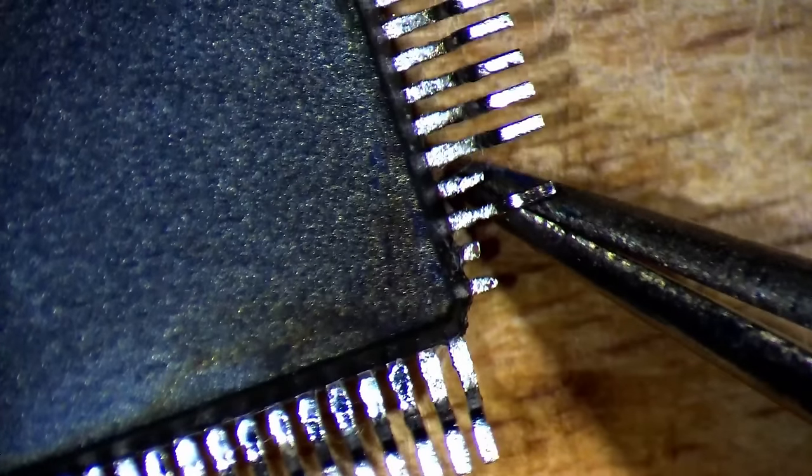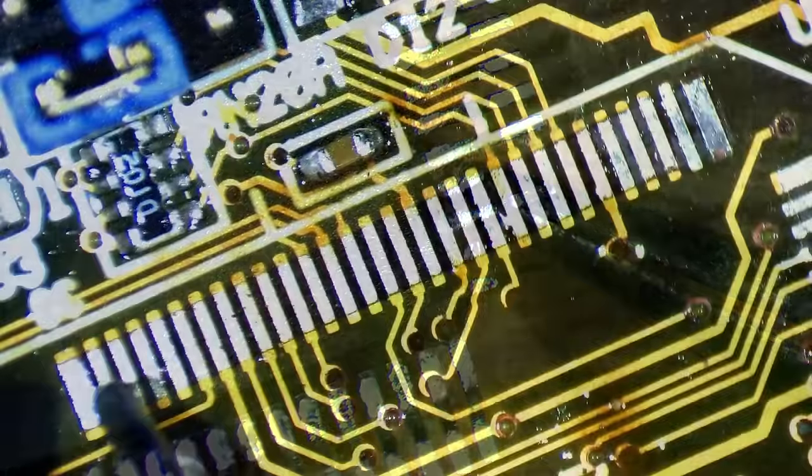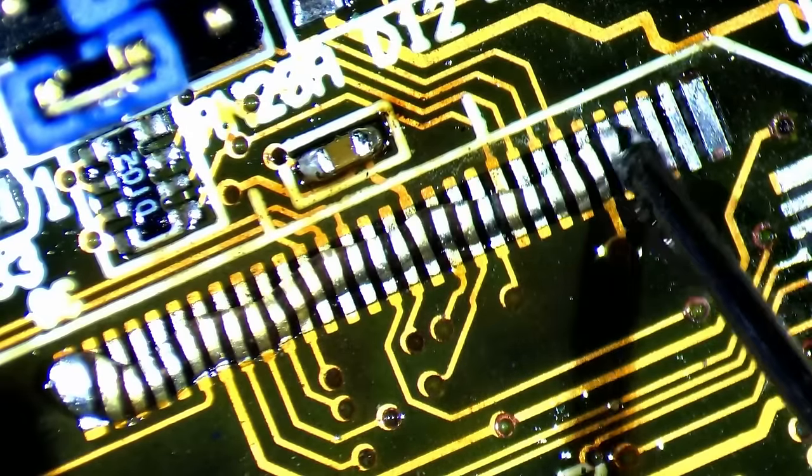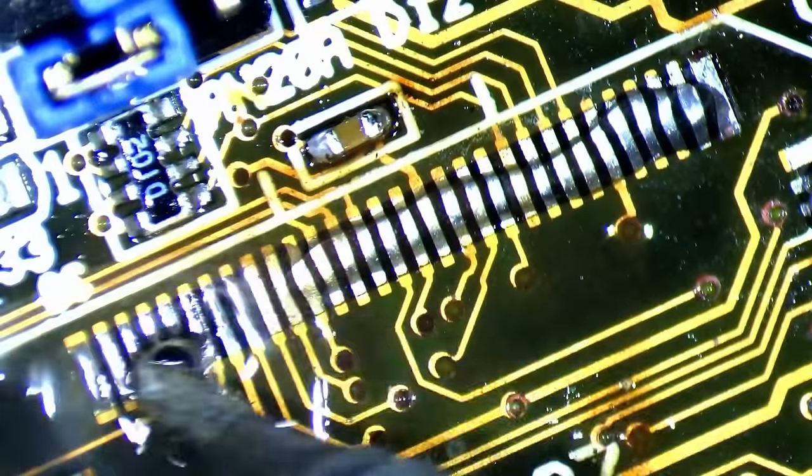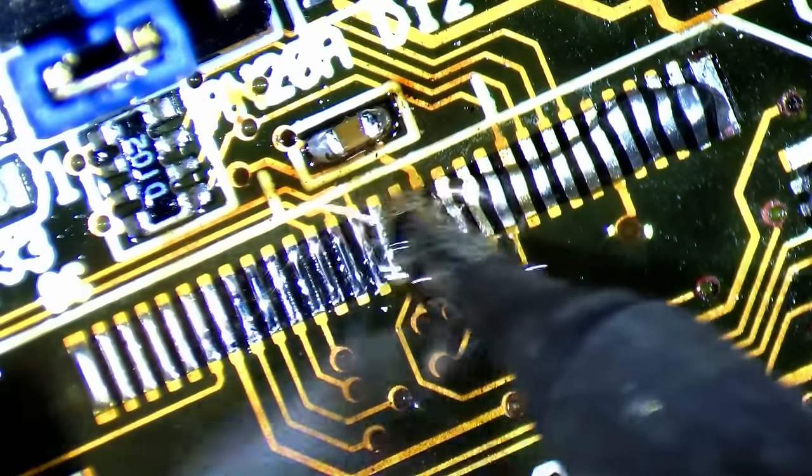The ASUS chip is clean and ready for later when we place it back in its original spot. Unfortunately, one additional pin broke off while I removed the chip from the motherboard. I suppose all those hours spent mastering the art of reattaching replacement legs on 3DFX Voodoo chips will finally pay off. But let's turn our attention to the pads on the board now.